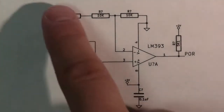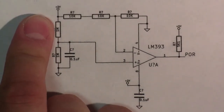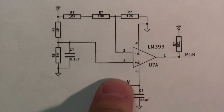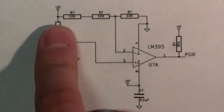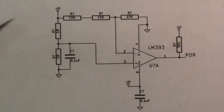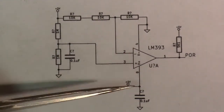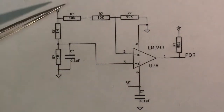This particular circuit is a power-on reset circuit — really just a delay circuit. When the five volt supply is applied, it's going to delay the rise of the output by a certain amount of time. There's a small bug: the LM393 has a sort of inconsistent power-on state as power is applied. You've got plus five volts to both of these, and as power turns on you're going to get the internal state of the op-amp oscillating as the power rail rises to a certain point.